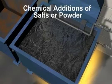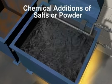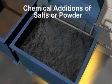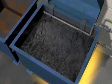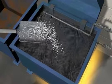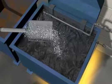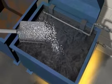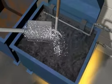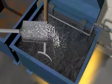The liquid level in the tank slowly creeps down due to drag out by parts. To keep the tank volume at a constant level, chemistry has to be added to make up for the loss. Powder or salt such as Blackmagic Infusion Powder or ABM Plus are slowly sprinkled or sifted into the tank. Adding the powder can only be done while the tank is being mixed or boiling to ensure the powder dissolves into the liquid. Adding slowly is necessary since large slugs of solids will cause boiling over from the chemical energy introduced into the tank. Also, solids can accumulate on the bottom of the tank and cause superheating and tank eruption.